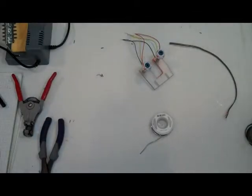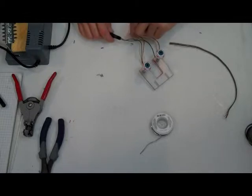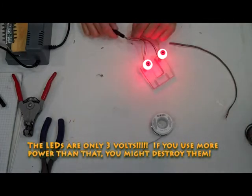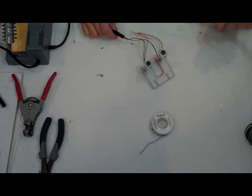One thing I wanted to point out is that it's important to test things as you go. So far with this set, I've wired the eyeballs together — the LEDs within the eyeballs — and I'm just going to quickly test them to make sure that the colors are all working. And they are, so I can go ahead and solder on my extension wire.